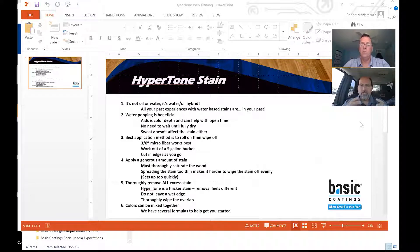When we talk about removing the stain with the rags, a lot of people question why we can't use a t-shirt. A lot of it has to do with absorbency — when you're talking about making sure all that stain is removed, terry cloth works best, so that's why we recommend it. When you're wiping the stain, working on those lap lines as a key focus point helps you prevent the lap line. Every time I've been on a job where the guy struggled, I found out they just didn't wipe those laps thoroughly enough, hence leaving a dual layer of stain in that space, getting your lap line.